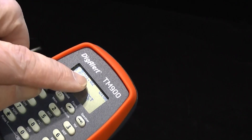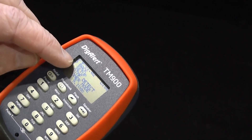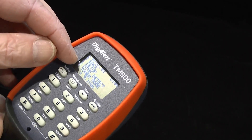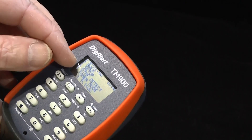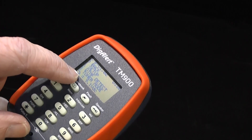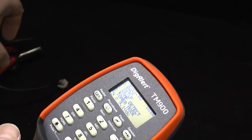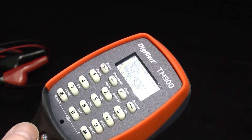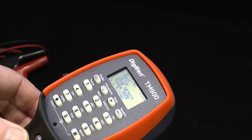We have an option to go back or out of this menu, we can go into setup, and we can do DTMF detection or toner mode. On the bottom line we have the battery status and its voltage. If you are used to pair tracing, then this can effectively become a pair tracing oscillator.